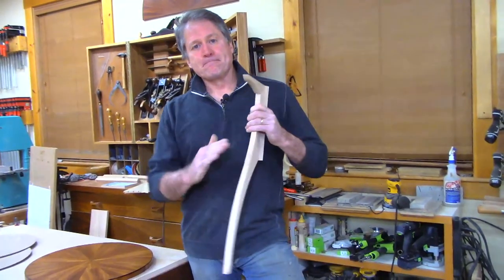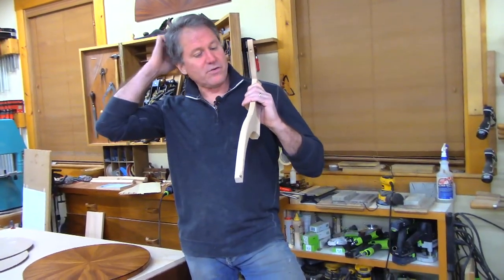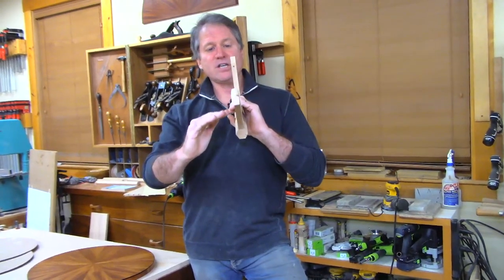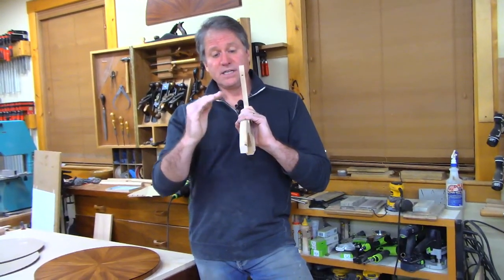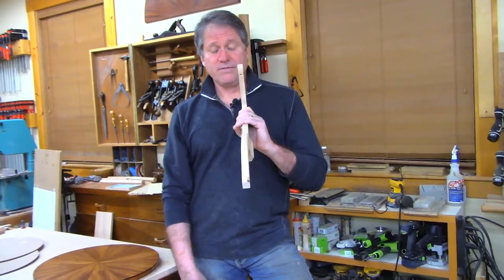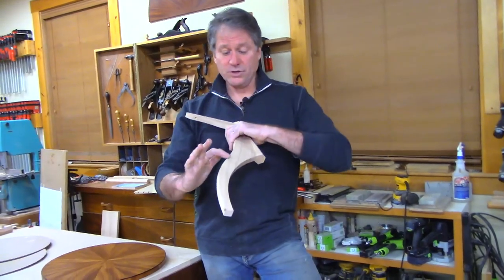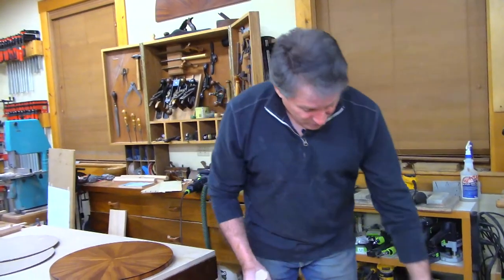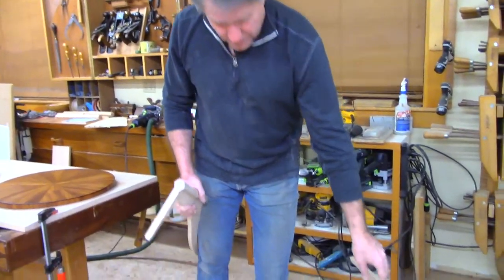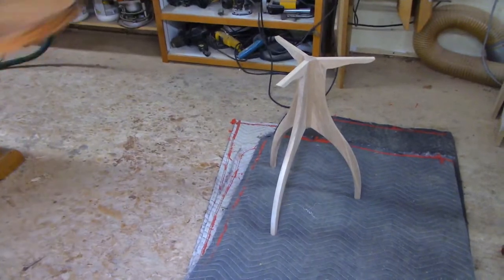On the concept of 'pillowing': when you put a very soft radius on an edge or surface like that, it's just subtle — there's not a full round-over, you still have an edge on the corner, but it changes things so much. It makes a big visual difference with that soft curve on the bottom of the leg, and it works well together with the rounded top.